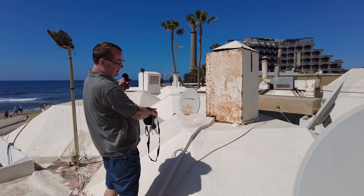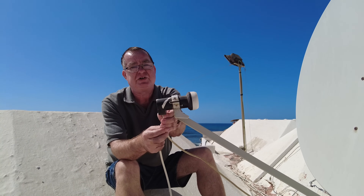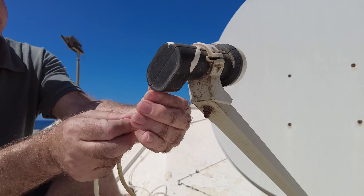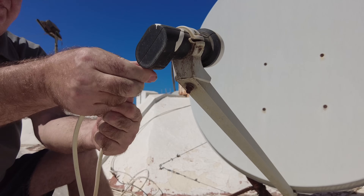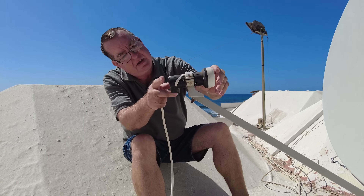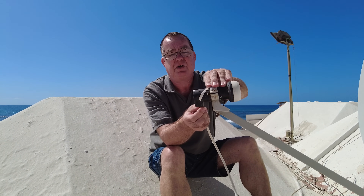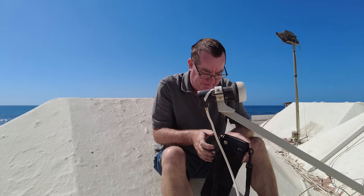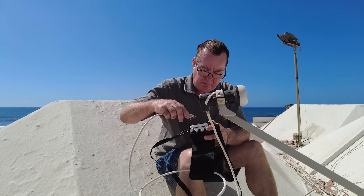This one over here is the BeIN Sport dish. The first thing I'm noticing is the connector on this — it's completely corroded solid. That is really, really bad and that might be the problem — could well be the problem. We're going to unscrew this; the LNB is maybe twisting over a bit too much. I'll put my satellite meter on and see if I get a good signal. The strange thing is the channels he has working and the ones he doesn't are actually on the same frequency, most often.